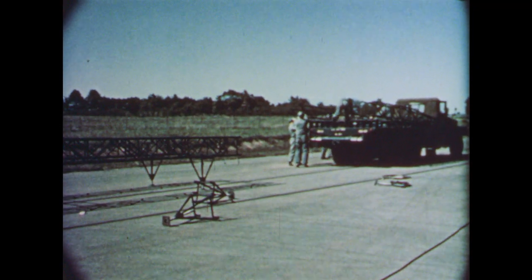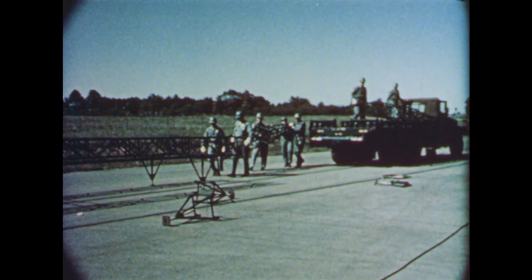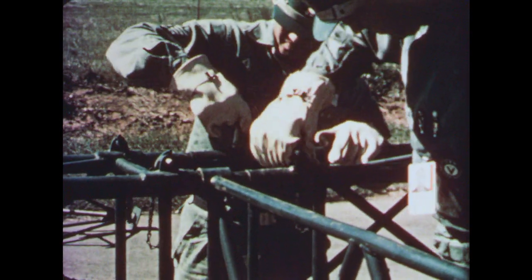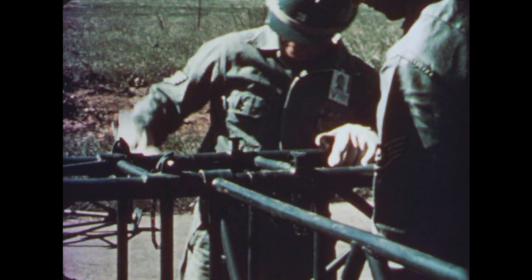As soon as all spreaders and jacks are in place, a number four section is taken off the truck. The truck is driven away from the launcher as the sections are lifted off. These self-locking pins used throughout the system are a patented commercial item that use small hardened balls as a locking feature.